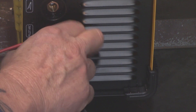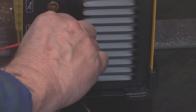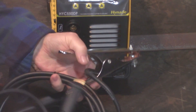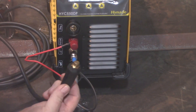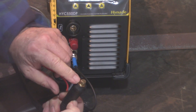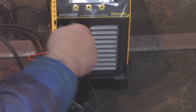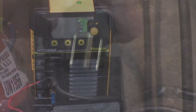Here is the switch that goes to the torch — it's got a key on it, push that in and snug up the little chrome collar nut. Next up, the working clamp goes on the top connector on the front panel. It's got a little key tooth that goes into the groove — it doesn't snap or lock, just give it a little twist until it gets firm.